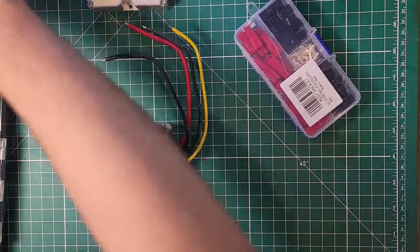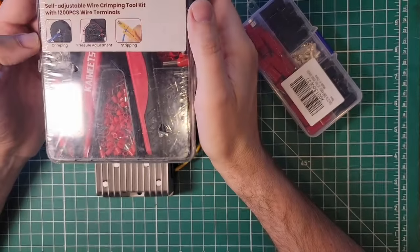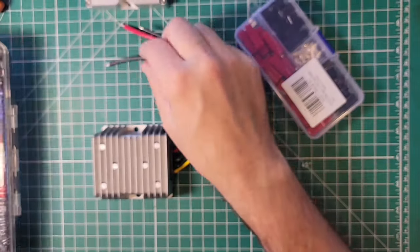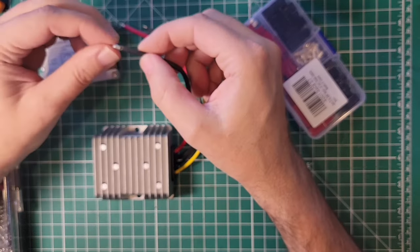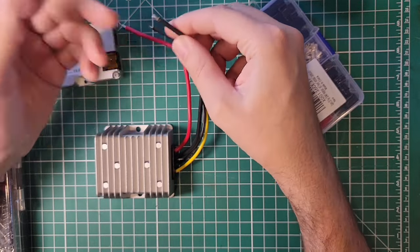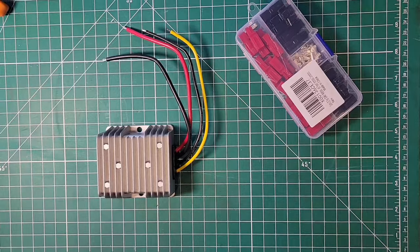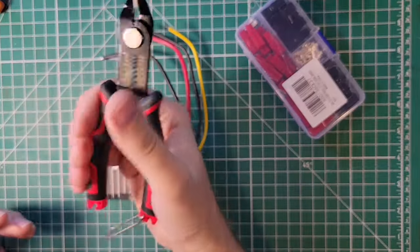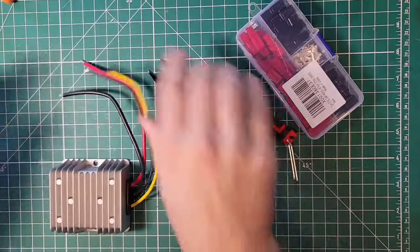We have wire strippers to strip the wires. And then we have this thing here which is actually really neat — these are what's called ferrules. These make it so that you can take these bare wires and insert them more often without having everything fray on you. These are actually pretty nice and already tinned. These tools are from Kaiweets and this is from iWIS — I will have links to all this stuff in the description down below.